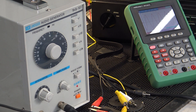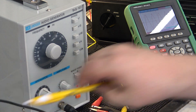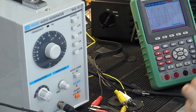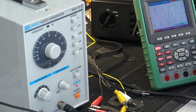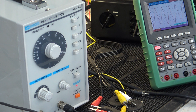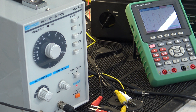What we've got is this on the right-hand channel. I've adjusted the volume on the amplifier until it's exactly six divisions. That is exactly six divisions — we're looking at 400 hertz, and I think it's 200 millivolts per division. Anyway, it doesn't matter what the measurement is — it's whether it's the same. I'm now going to swap this all over for the other channel.